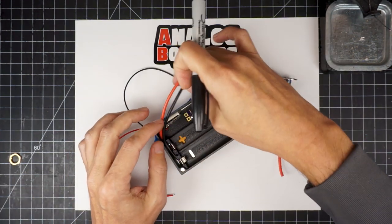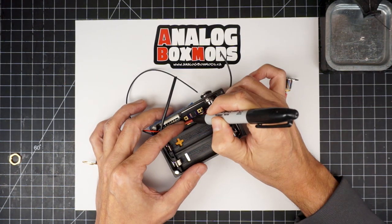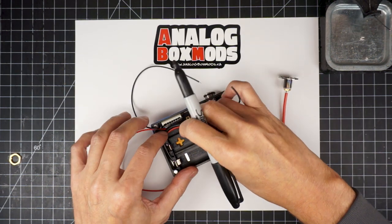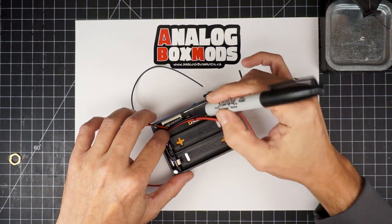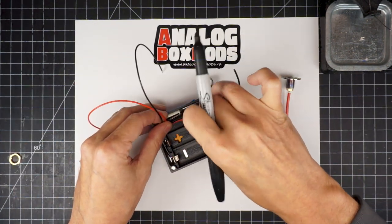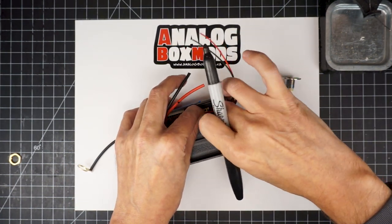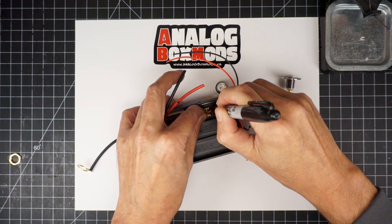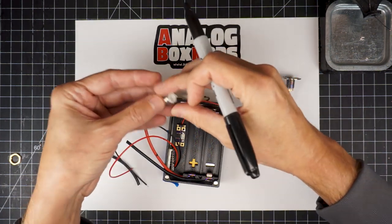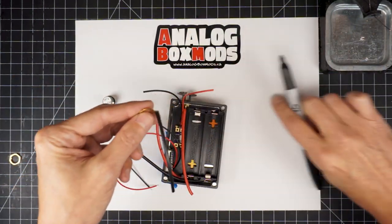And first, the wires coming off the battery. Give yourself a good centimeter longer than you need, because we're going to strip a bit and then it needs to bend down into the through holes on the board. So at least a centimeter, about a quarter inch longer than you need for all of these wires. That was the voltmeter we just measured. And then the 510.